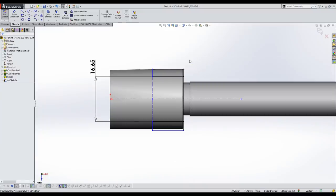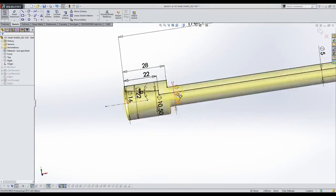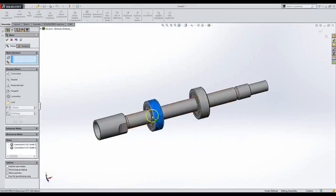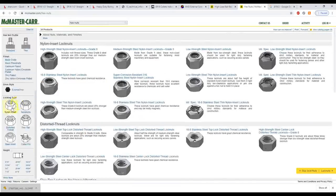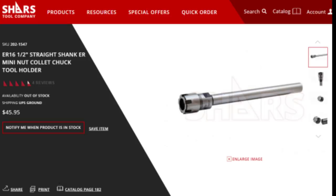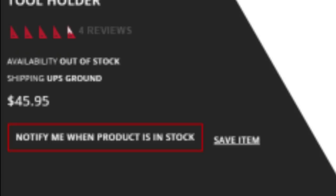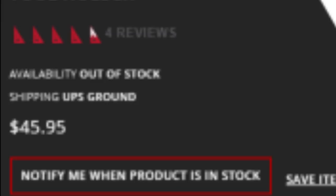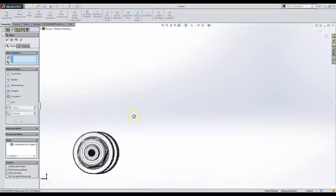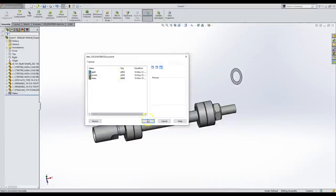I knew I'd be designing using a straight shank ER-16 collet holder, whatever bearings would fit that, a motor, and a belt drive. Straight shank collet holders are pre-hardened, have a super low runout, they're ground very precisely, and they cost very little — you can pick one up from Shars for about $45. Actually, it was $45, then $30 shipping, then $30 at the door for duties, and then a $30 brokerage fee several months later. Ah, Canada. It's easy enough to change the motor, the bearings only have to survive making the part, and I can replace the belt as often as I want, so I wasn't too worried about the calculations here.